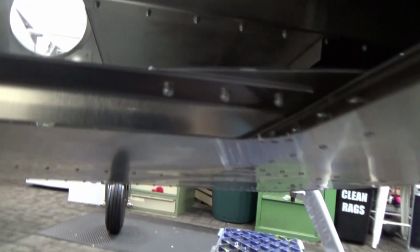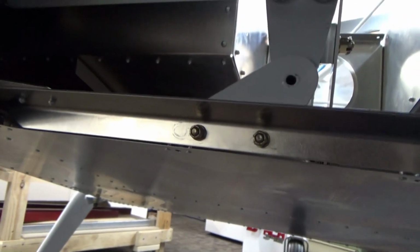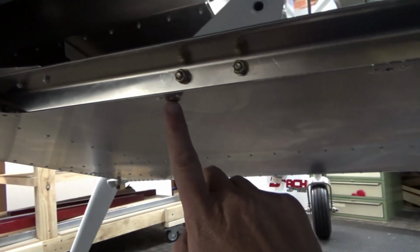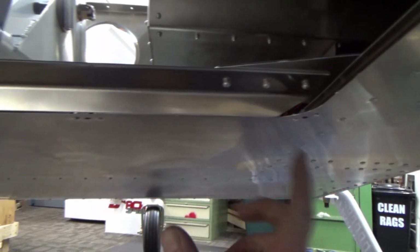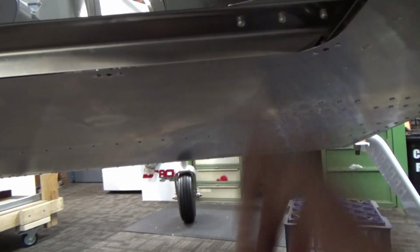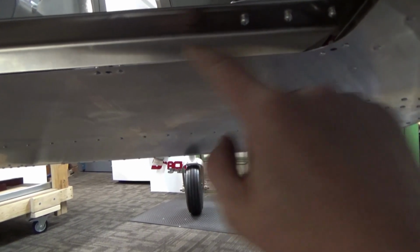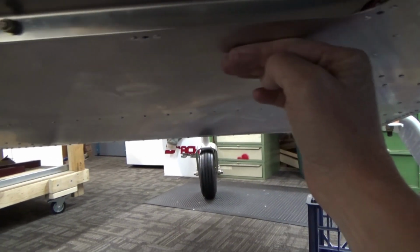So what's going to happen now, this can just vibrate. So my plan is, I've got anchor nuts, so an anchor nut there with this steel plate, another anchor nut there. So in between the anchor nuts, about 90mm, I'm going to put an L angle on the back. Bear in mind this isn't 90 degrees to the skin, so I'll get the angle right. L angle, dimple it and countersink the rivets, because the hatch will go over this as well.